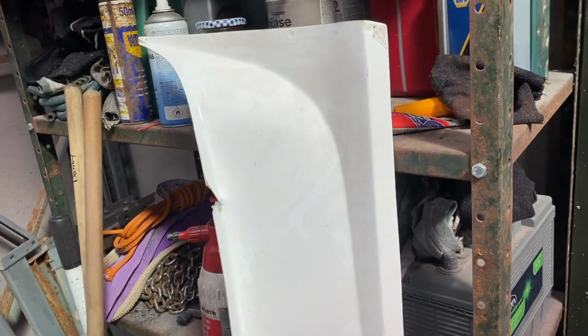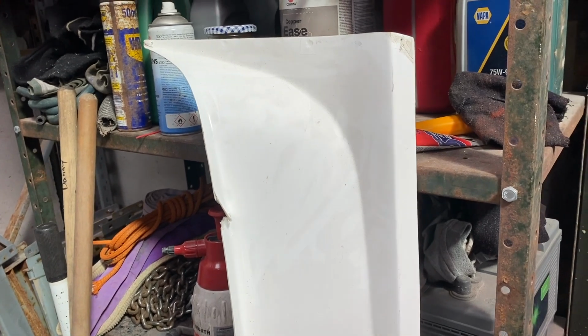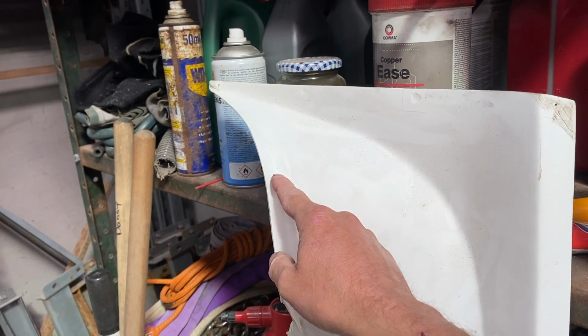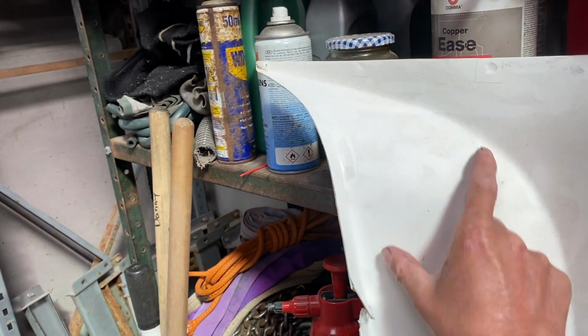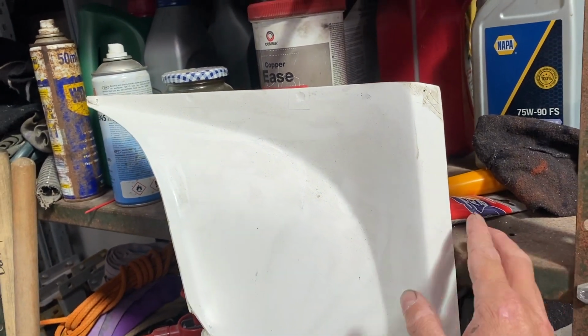So let me show you what I mean. This is the front splitter off the Audi build. If I was doing this and not learning skills, I would do this technically in a few pieces. So you do this edge first, weld it to this along that seam, and then you do this the same along that seam and that one, and then fold the edge.